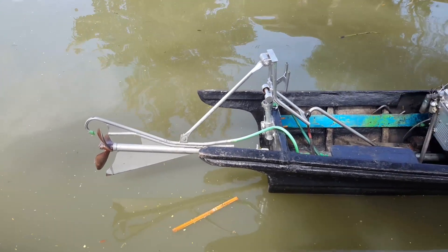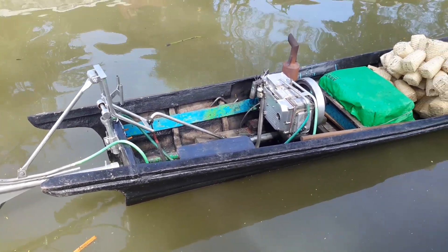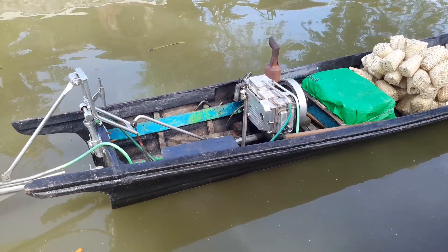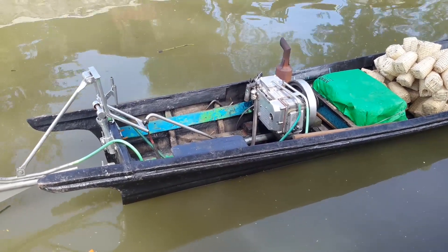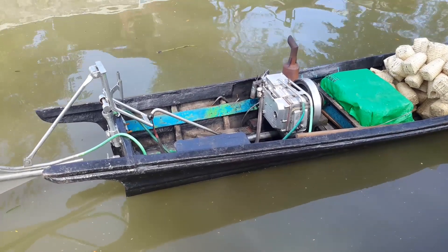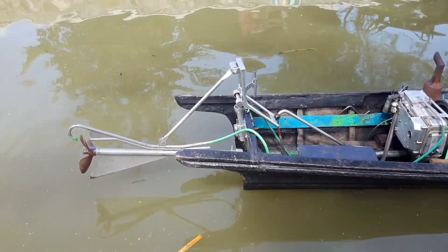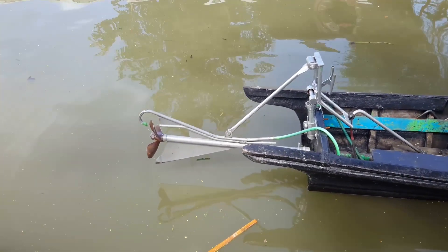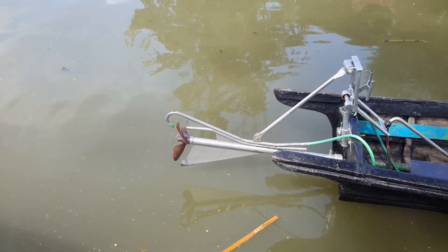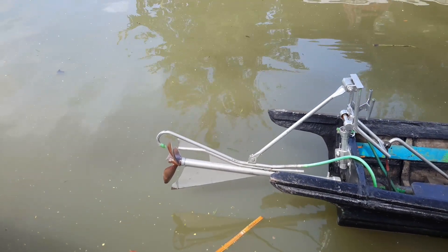so the propeller is pushing water into that tube behind the propeller. And then it goes — you see there a green tube — and comes up on the engine there. And there is the outgoing water, I think, the dark green tube, which sometimes is connected to the tube in front of the propeller to help suck the water through the engine.